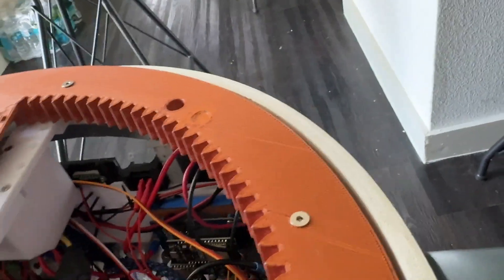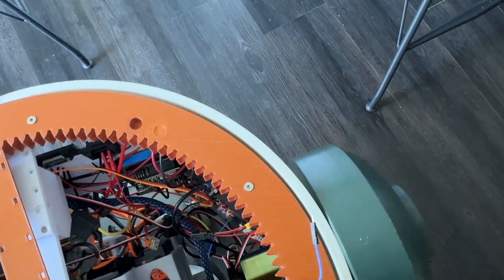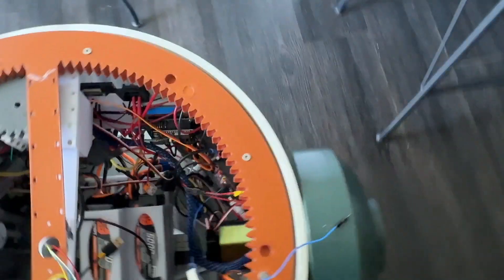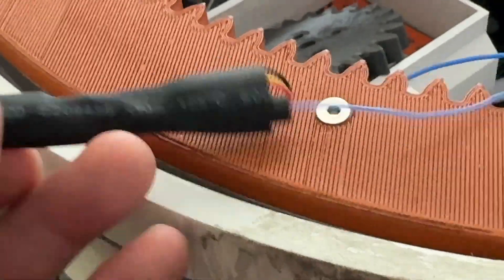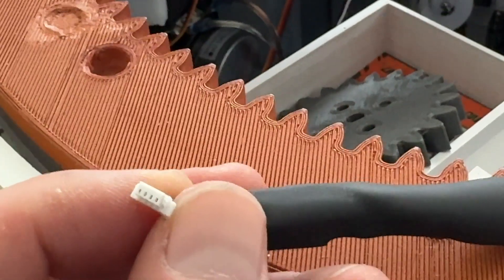To make the magic work, what I've done is wired onto the positive terminal of my fuse block this blue wire, and it ends in a little pin. I'm going to plug that into the blue wire of the harness I just showed you and then plug the harness into the back of the receiver. I put a little heat shrink on the connection to make sure that doesn't wiggle loose and just corral the rest of the wires. Then I'm going to plug this back into the port on the back of the transmitter.